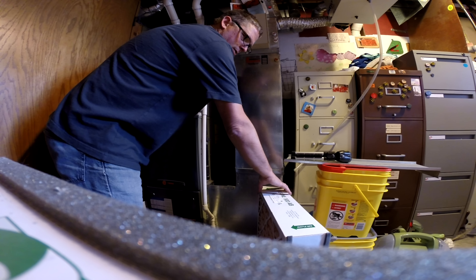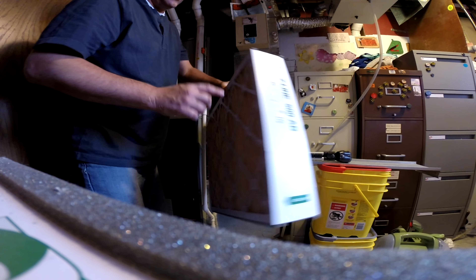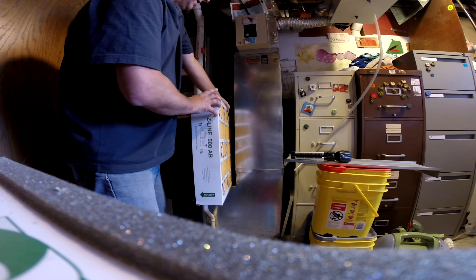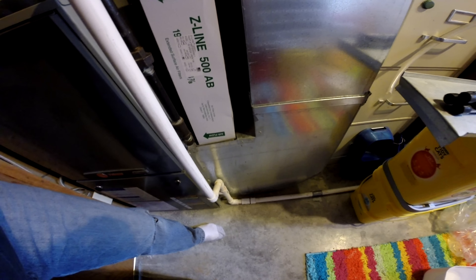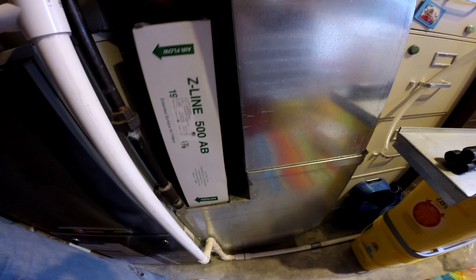You're not seeing where the flame is — that's on another part of the furnace which we are not accessing; it's actually up here in this area. It's very clean in there, so it's ready for the new filter to carefully be put back in. Again, it's very easy. You go with airflow pointing that way. It doesn't matter if it's this direction or that direction — airflow aims toward your furnace. Now fit it in there. So it'll be a tight fit; you might have to push it in and wiggle it a little bit.